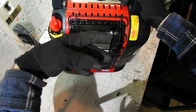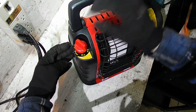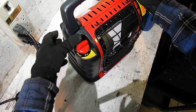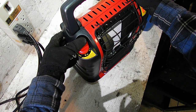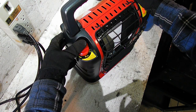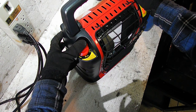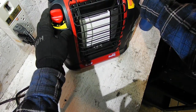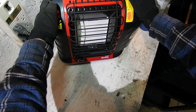I don't have an owner's manual, but from watching videos online, you take this valve control knob, push down slightly, turn it into the pilot position. You hold it down — if you push too far it clicks and runs the little spark down in the pilot. You hold it down, then push it all the way, it sparks, and you keep it held down for about 10 seconds. Well, it sparks, but it never lights the pilot despite my best efforts.